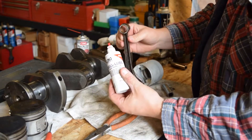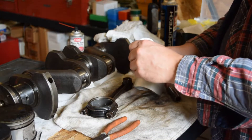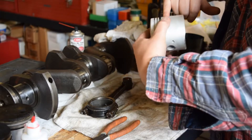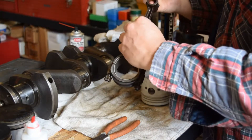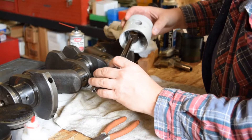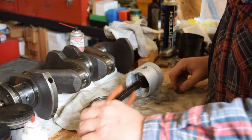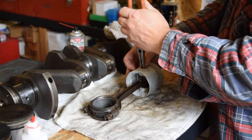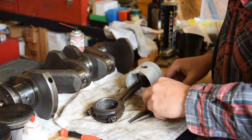Arrow and number on the same side when it goes together. I'm using this lube that we've used for other parts inside the engine — just a little bit to give it some lubrication. I put a little bit on the piston as well, so it has some lubrication when it starts out, because when this tractor fires up it's going to take a few moments for the oil to start flowing. The pin isn't just dropping in easy — I'm pushing with a little force. For those who say you need to take these to a machine shop, that's fine, but these finely fitted parts seem to be okay.